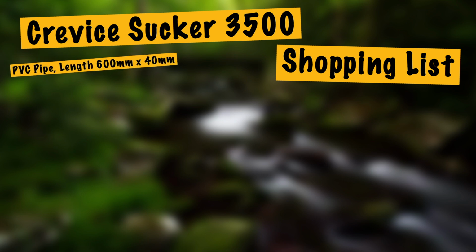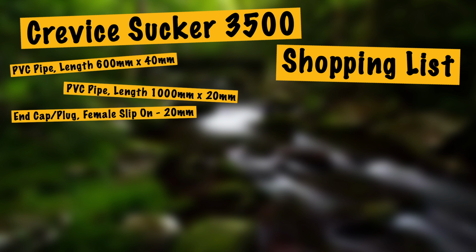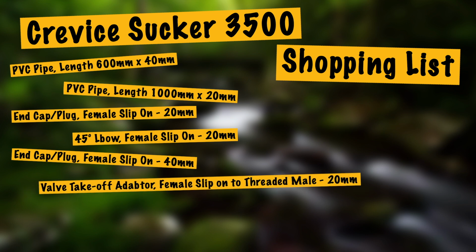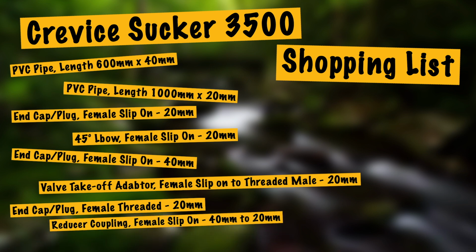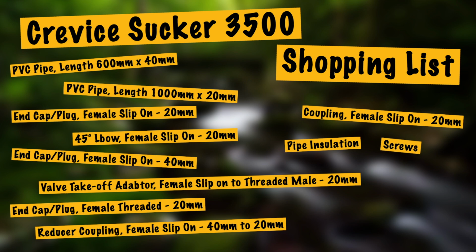So you've got your 40mm diameter pipe, 1 meter length, your 20mm diameter pipe, 1 meter length, your 20mm slip-on end cap, female, your 20mm slip-on elbow, 45 degree, your 40mm diameter end cap end plug, slip-on, your 20mm valve takeoff adapter, slip-on and male threaded at the other end, your 20mm diameter end cap end plug, threaded, female, your 40mm to 20mm reducer coupling, and then your 20mm coupling, your pipe insulation, your screws, and some electrical tape. So take a screenshot of that so you can put that in your pocket and take it down to the shop and buy all the bits and pieces you need.